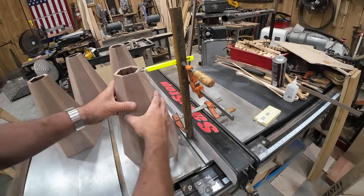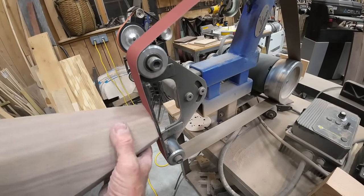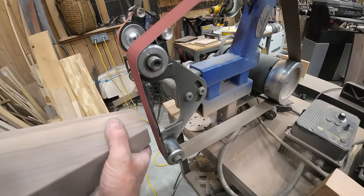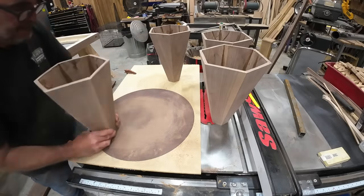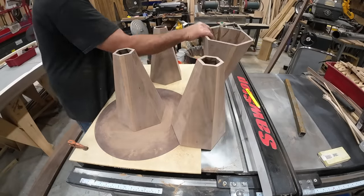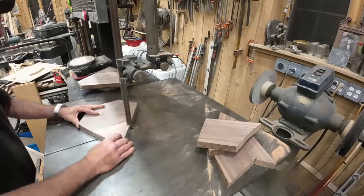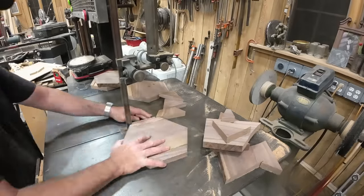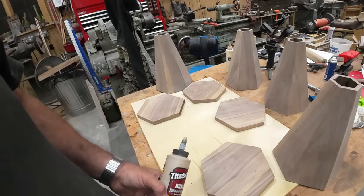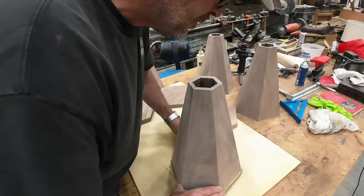With a pencil I'm marking the parallel from the opposite side on each one of them, then I go and hand sand right up to the line, bring it back over to the same big platen and hand sand everything right up to the line. My goal is to split the line in half — I don't want it to go away. These are the parts that are going to make up the cap of the big tapered leg, and I'm using the darker Titebond — it glues dark, fills gaps, works really well.